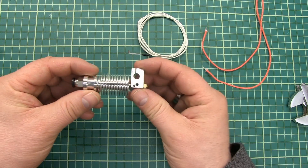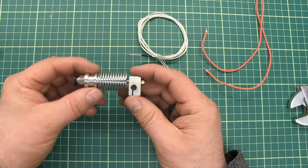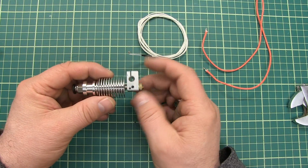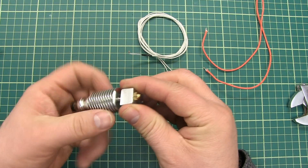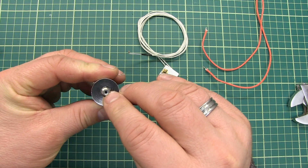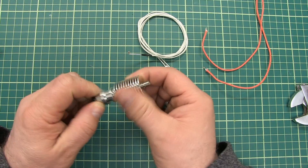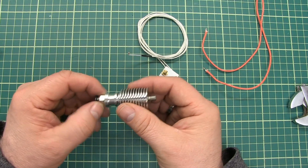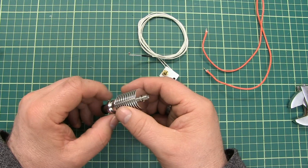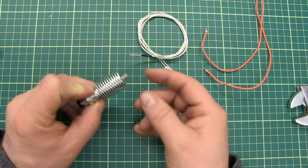It's easy to mount and not difficult to do. I prefer the original E3D V6 hotends — the ones I've shown you are clones, which have an inner liner PTFE tube inside. When you have the original E3D V6 it can be all metal, and when it's all metal with retraction settings on your printer, it will be less likely to jam inside the tubing.